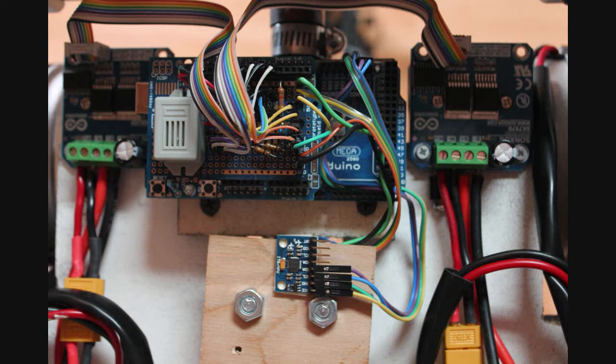This board serves as the primary landing site for most of the control signals and also serves as the logic power distribution center. It is also the host for the Radio Shack electronic buzzer, as well as a few resistors and capacitors which are used to sum and filter the BTS current signals. The serial links to the MPU and the topside Leonardo are tied directly to the Mega. With this layout, I'm happy to report there have been no interference issues or processing lockups. The one downside is the buzzer, with its 79 dBA output, is really inadequate to be heard over the motor noise, which is mostly gear noise — ordinarily a lot less if these motors had been fitted with helical teeth rather than the flat ones they actually have.